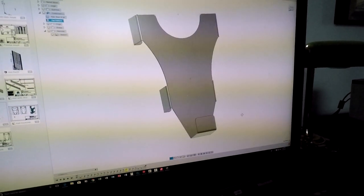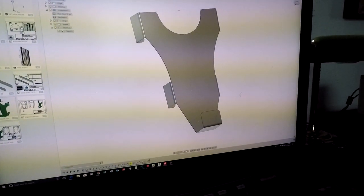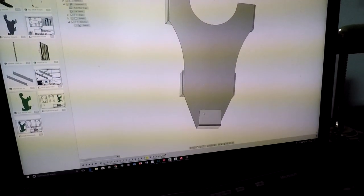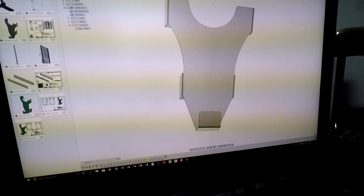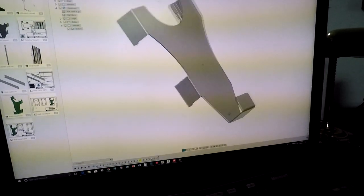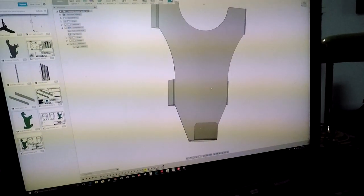And I think we'll be fine. I lengthened it in through here so it's a little longer because it was looking a little short and stout. So I made it just a little bit longer. This guard I shortened, it actually was hitting the trigger. So I figured we can lengthen it here a little bit and we'd be able to avoid that on the bigger polisher. And it should fit the smaller polishers just fine because it's all standard 4-inch head right here.